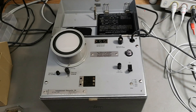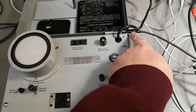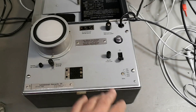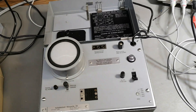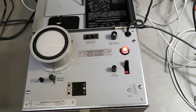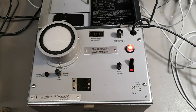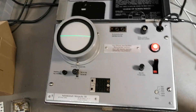Let's try and power this up and see what kind of power consumption we get. I've dimmed the light and connected my chassis to earth protection because the mains cable didn't have a third pin for chassis grounding — I really don't want to electrocute myself. Mains is now applied, and I hear a lot of hum. There's a line, exactly what I thought.